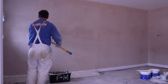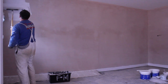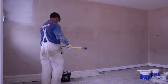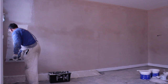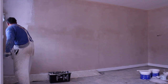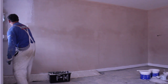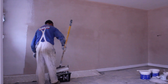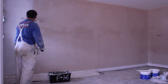It is very important when using a fresh roller or clean roller sleeve to work the roller into the paint material. This is quite difficult with new plaster work as the plaster sucks in the new paint. So I have to work that roller sleeve and immerse it into the paint so it is completely covered. We dip half the roller into the paint and then roll up towards you, and then we are ready to go.